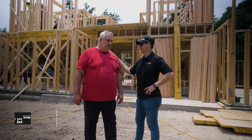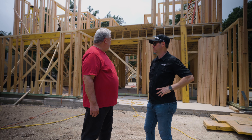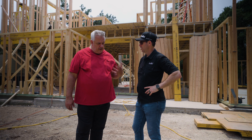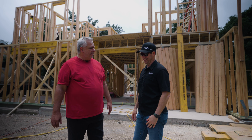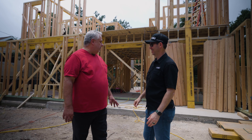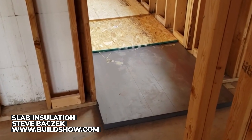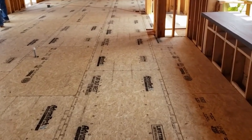Welcome to the job site, Steve. It's day four, just after 1:00 PM — 3.5 days of work and we've gotten this far. As Steve points out, exceptional design work upfront really provides expedient framing. We're utilizing a slab-top insulation detail that Steve developed, and we've only installed load-bearing walls so far — the non-load-bearing interior walls haven't gone in yet. Steve explains why: they want to install the insulated subfloor first.